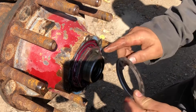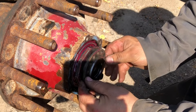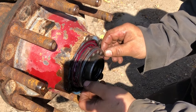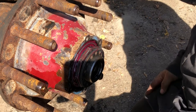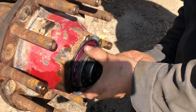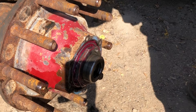Hopefully it'll match up. It doesn't match that way, so turn it around — and it doesn't match that way either. We don't want to go any tighter; we have to loosen a little bit. If you go tighter it puts more preload on your bearings and then it'll run hot. So we're going to go back just a hair — actually one width of that slot. We'll see if that'll fit on here now.